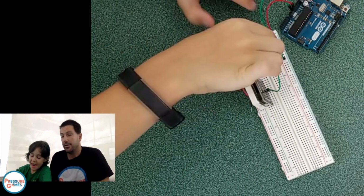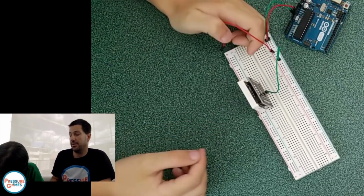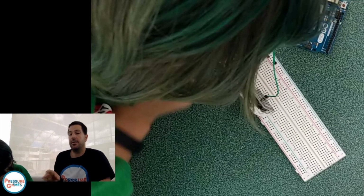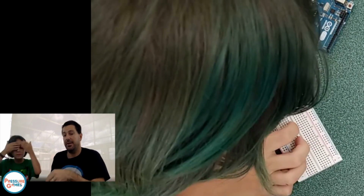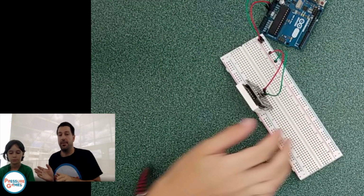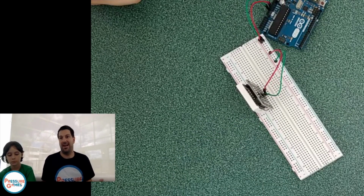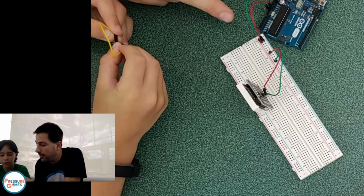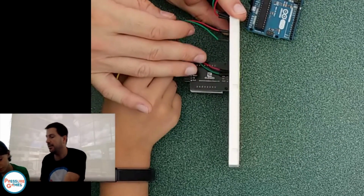All right. So this is not the most exciting time where you're putting in wires. I'm putting it in VCC. Yep, that's where it goes. The neat thing about this, and what makes this so exciting, is that last week we had one wire to turn on one light. What we're going to start learning about today is how to use one wire to control a lot of lights. Wait, I thought that's 2 wires. Well, it's going to be 3 wires. There's clock, CS, and D in.